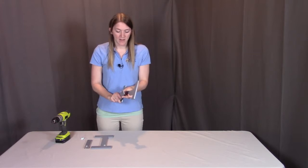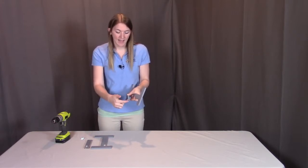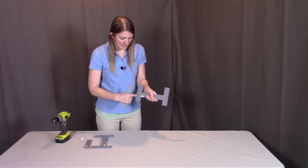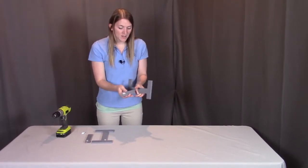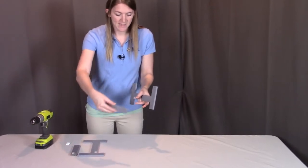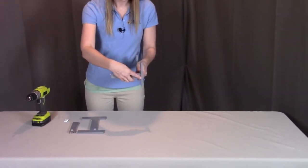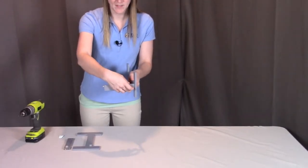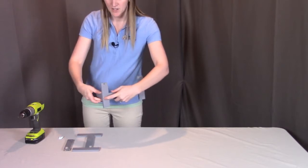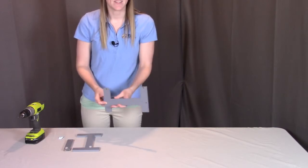The rails have on the very end a hole and a peg on each side. You're going to want the peg at the top, going into the two holes here on each side. When looking at the rail, you're going to see the side that has the plastic inserts — you're going to want those facing in towards the center so you don't see them from the outside. We're going to put in that wooden peg on the top hole and screw through the outside to hold this rail into place. Then we're going to repeat the same thing on the other side and get these screwed in.